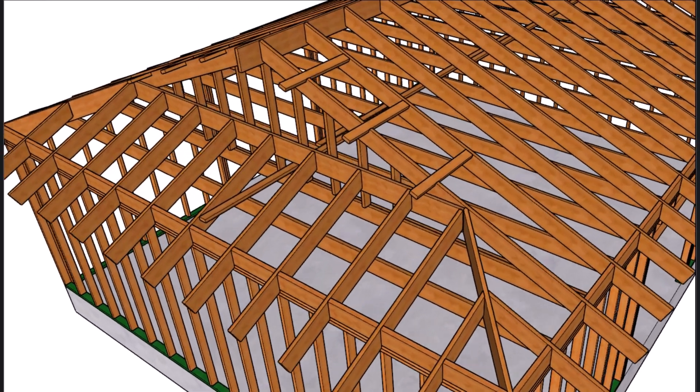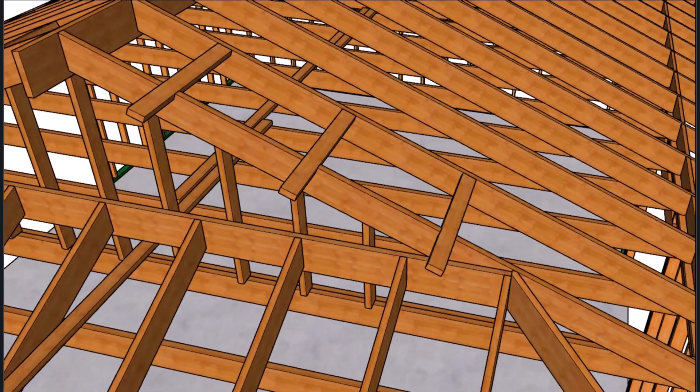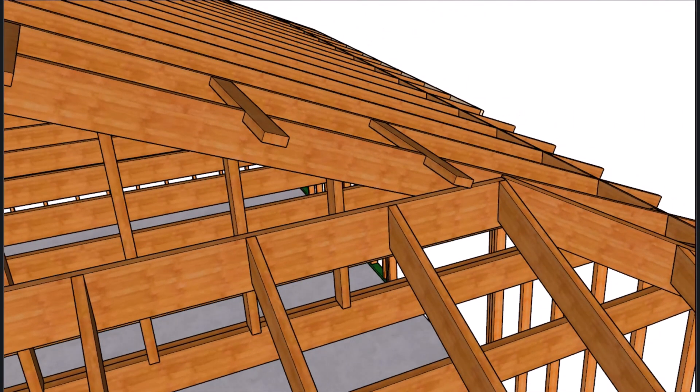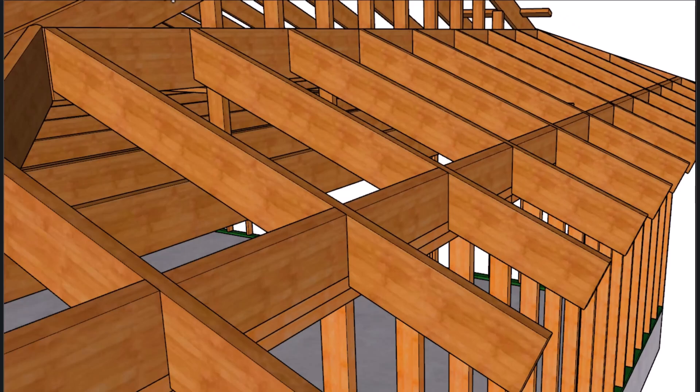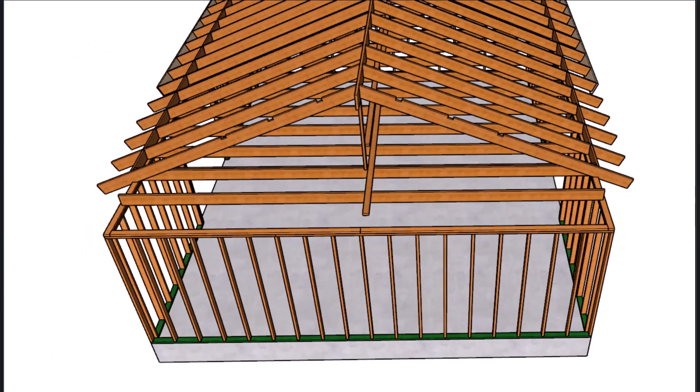Let's zoom around to provide a few more perspectives. For a Dutch roof, we're going to have a setback — a measurement where the longer common rafters will start. In this method, I'm going to be using a doubler, though you can always install a beam instead. I'm going to be installing gable studs on top, which will be used to support the ledger for the shorter common rafters, as well as create a wall to attach stucco, siding, or other wall finish materials.